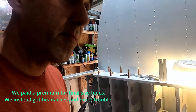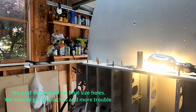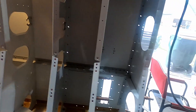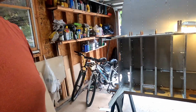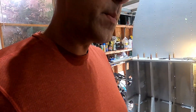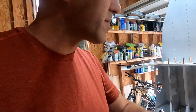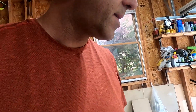Most of them have cracks. Some of them don't — but what do you do now? Looking closer at this gear brace, this angle here — these number 30 rivets that attach it to the skin — 40% of the number 30 rivets that attach that thing to the skin, that are dimpled, have cracks in the dimples. When I dimpled them they didn't have cracks, but they got cracks upon riveting. How is that okay? It's not.